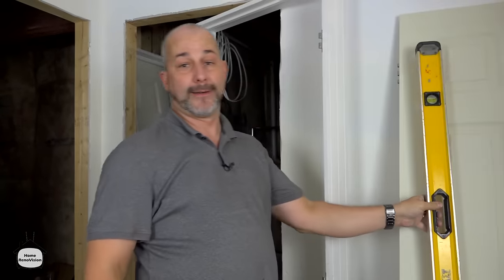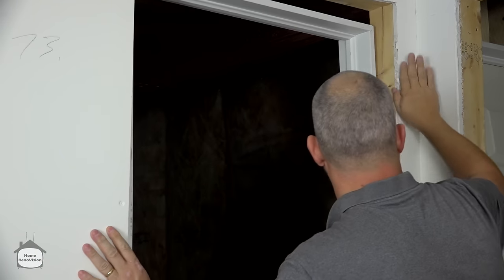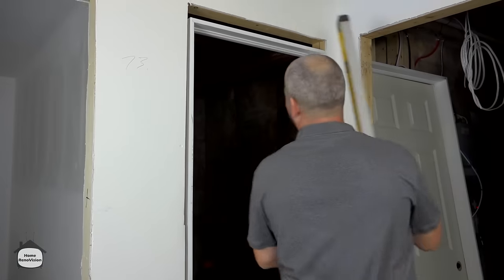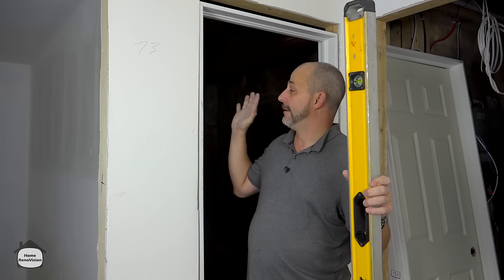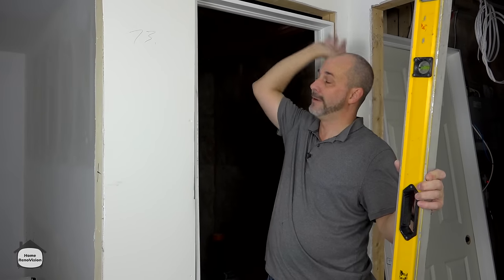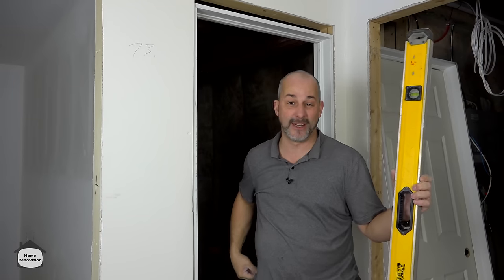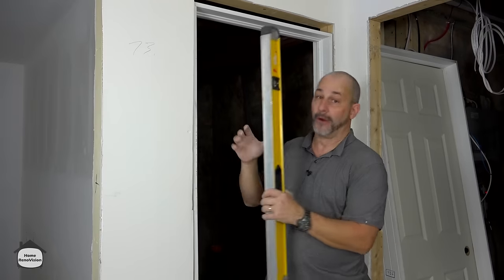Just because the door is pre-hung doesn't mean you want to leave it on the door frame while you're working. Yeah, not a lot of mercy here. Okay. So let's just talk doors real quick because you want to have an idea of what's going on. This is a 30-inch hole, rough opening, wood to wood. So we got a 28-inch door. Traditionally, jambs are 5/8 thick, which gives you 3/8 of an inch, which is just a few millimeters of mercy if it's not level or plumb.